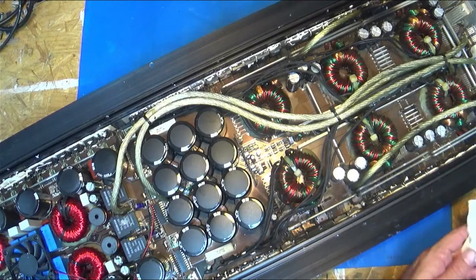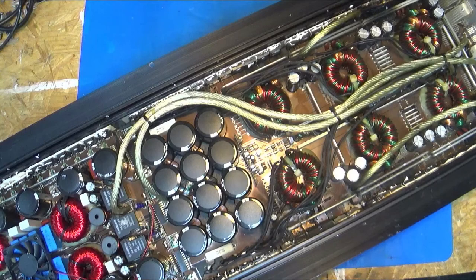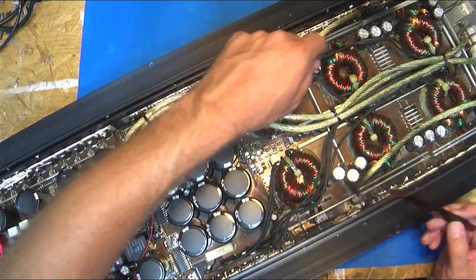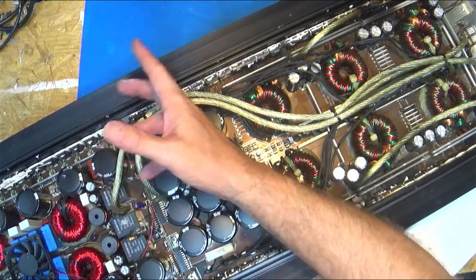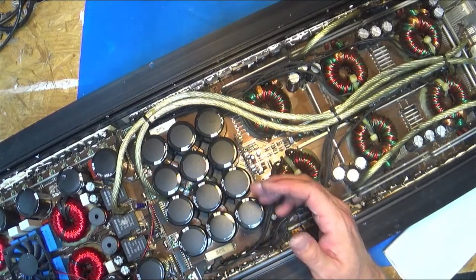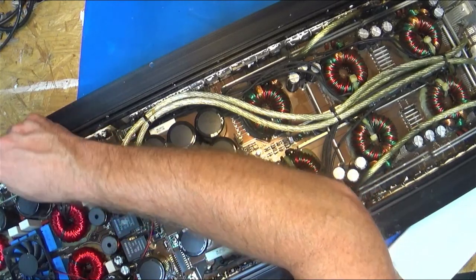That's also why they tell you never to have FETs installed if you don't have a way to tie the gates down. You'll see pull down resistors on all these output FETs and a lot of times on power supply FETs that help make sure that, besides the gate resistor, which is where you send the signal to turn it on, there's a high value pull down resistor that keeps that gate leg shut off so it can't accidentally come on. But some amps don't have that, and those are the ones that are really scary for vibration damage,